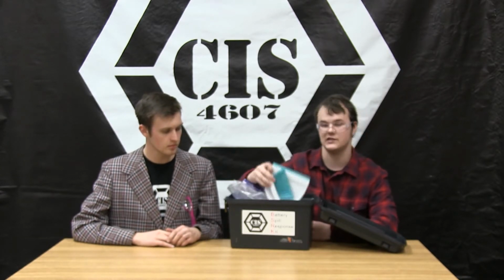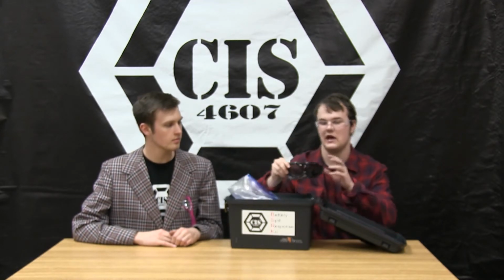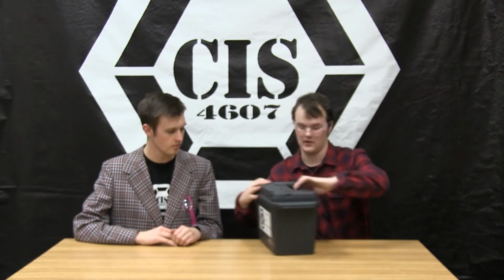We have some extra bags for the neutralized material, so like our baking soda that's been neutralized. We have a small dustpan and broom for sweeping up said neutralized material, and we have some splash-resistant goggles. Along with that, we include our SDS right on here, because that way, if you ever need to look at first aid procedures, any sort of disposal or containment procedures, you have them right here. But also remember, if you ever feel uncomfortable about cleaning up a battery, ask your safety captain, mentor, or someone that is trained on how to do that. You should not do anything that you are uncomfortable doing.